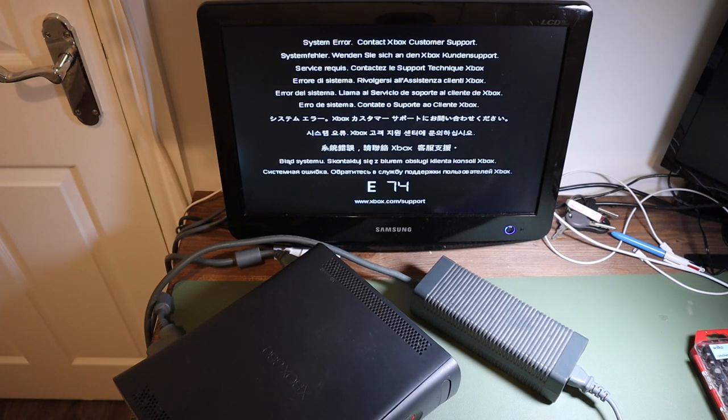We need to try and fix that error. From what I've read online, it's often associated with the chips on the main printed circuit assembly coming loose because they overheated. I don't know how easy that's going to be — whether I can reflow those somehow or whether it's a different problem — but we are going to have to tear into this to find out.